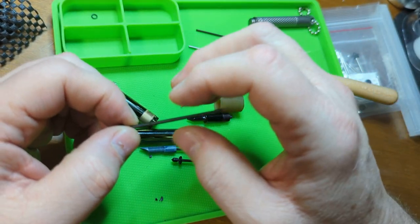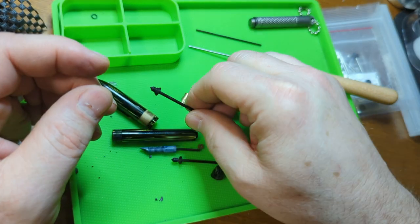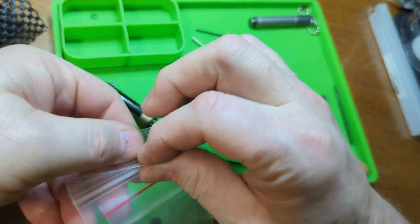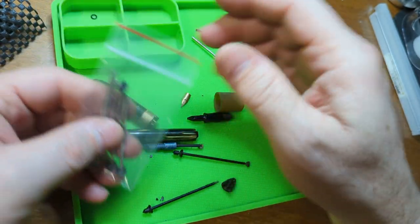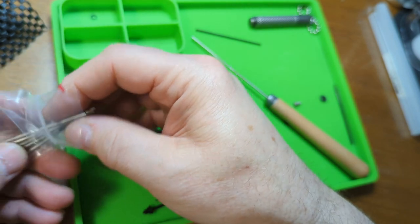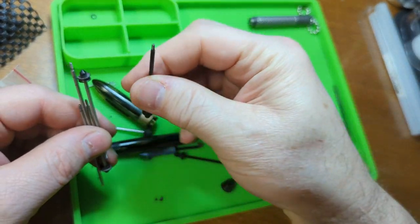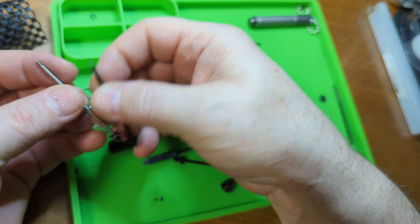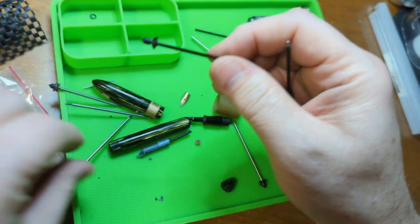So it's not going to be usable anymore because as you push this past a seal, it's going to allow air to pass around those ridged portions. These are a failure point. I've seen these where they've been rusted clean through and actually come apart in two pieces, or the plastic liner is all popped off with just a rusty piece of wire sticking inside. We'll need to replace it - and the nice thing about the internet is you can buy replacement rods. The later pens used stainless steel rods, and I have a couple of different sizes here.